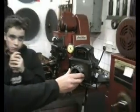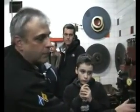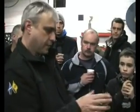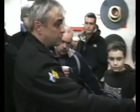So is that because of the diameter of that bolt? Right. Because what we've done is an interference bolt. We've put it into the hole, pushed it in, and it's now distorted the rod completely. Now if you take that to a standard rod that's never been resized, the standard rod is out to start with. Then you put that onto it, that compounds it. So that rod has got to be resized now.